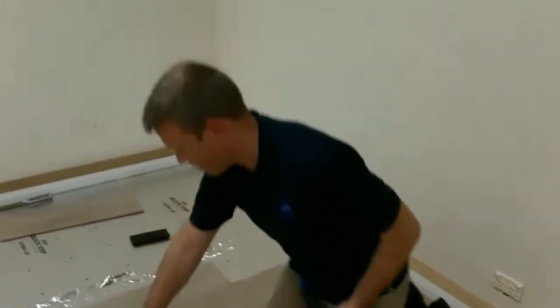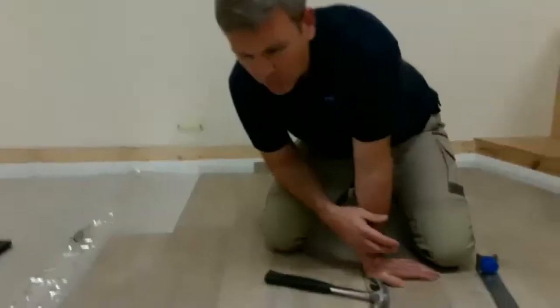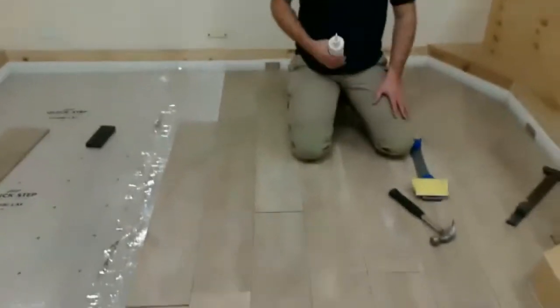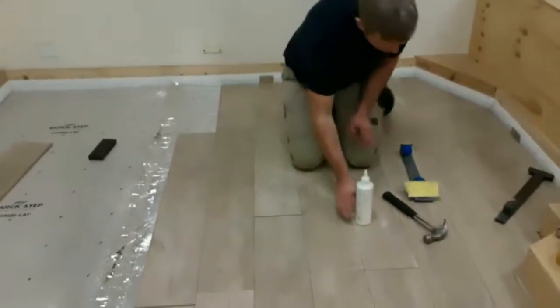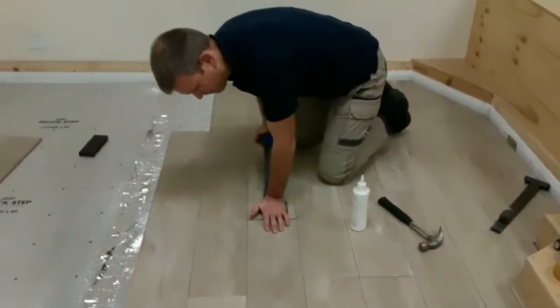And in actual fact, just demo this one more time. So say you've got a floor that's been installed recently and the customer's called you out and they've said, oh, look, we've got a board, it's got a gap in one of the header joints like this. What do you do? You could call us out and we can have a look at it, or you can get one of your installers out, and all they need to do is open up that joint just a little bit more.